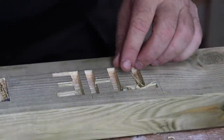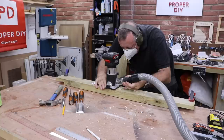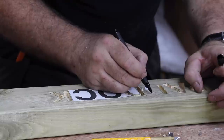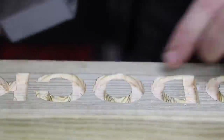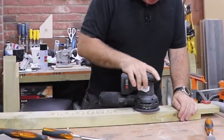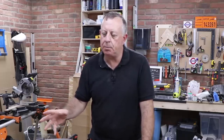I did have a mini disaster — the piece of wood between the T and the H came loose, which I set aside so I could glue it back in later. I found that routing the straight letters like T and H is an awful lot easier than the curves like C and O. What also happened was the paper tends to rip up, so to get around this I cut along the lines and highlighted them with a pen, which meant I could see what I was doing when I went back to the router. So essentially the carving is over and I'm reasonably happy with it — anything straight is far easier than anything curved, but with a bit of sandpaper and a bit of jiggery-pokery I think it's going to be okay.